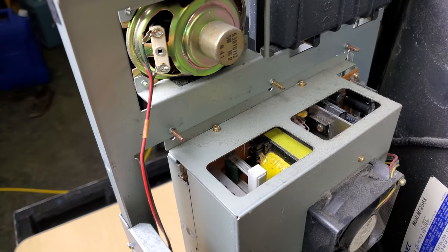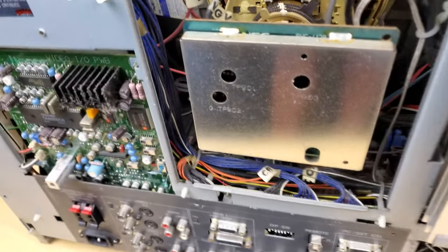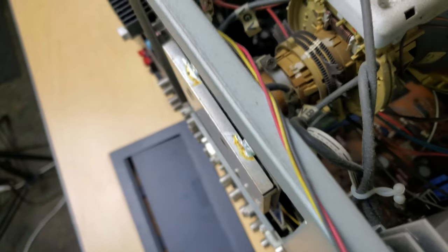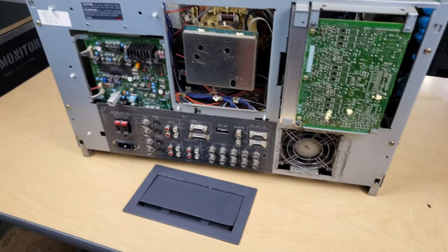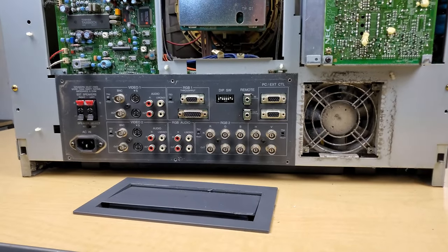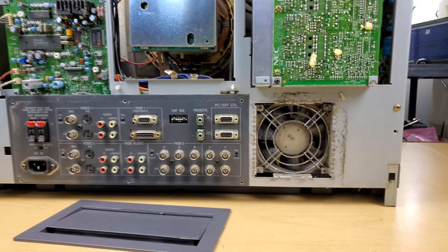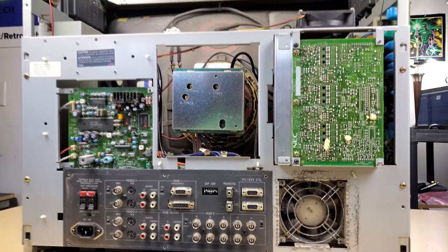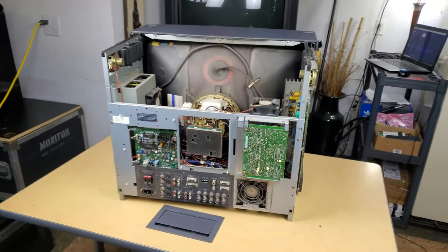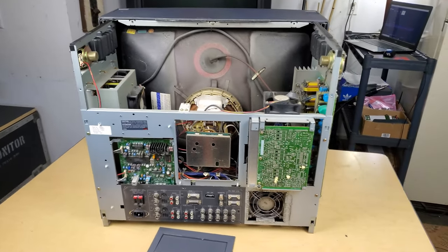We do have some tiny 5-watt, 16-ohm speakers here for the stereo audio that's built in. The neck board doesn't have any capacitors on it from what I can see — maybe that's why this daughter board has the capacitors and the color drives in it. It's just going to be a very large project, but I'm very glad we got it opened because in all seriousness it needs a thorough cleaning — but that's how you get it open. Now we just need to start tearing the boards out, working on them, and cleaning them. That's how you get the shell off — very, very difficult compared to just easy PVMs. All right, see you guys next time with some more retro content.